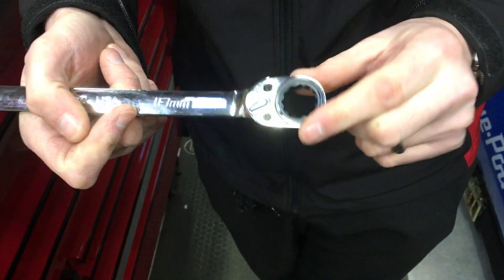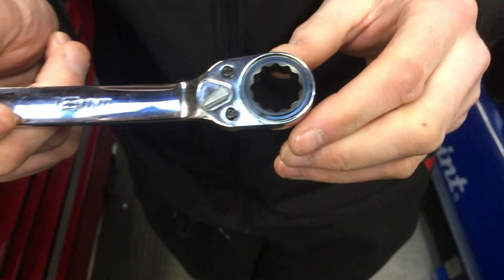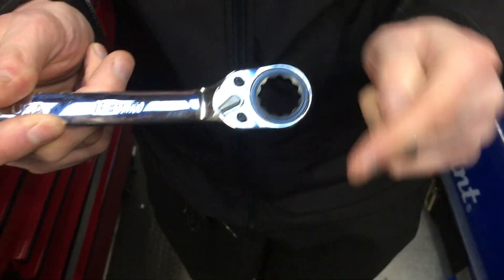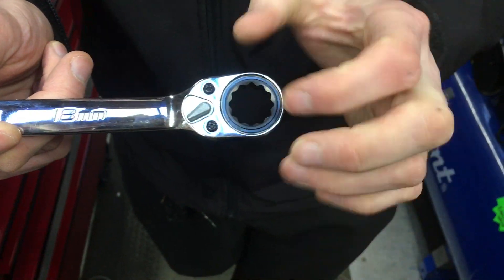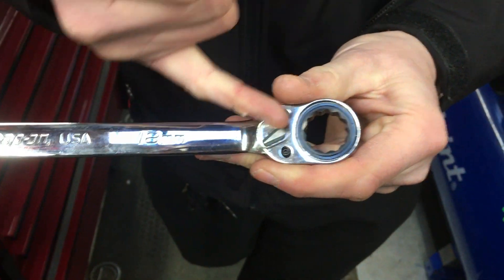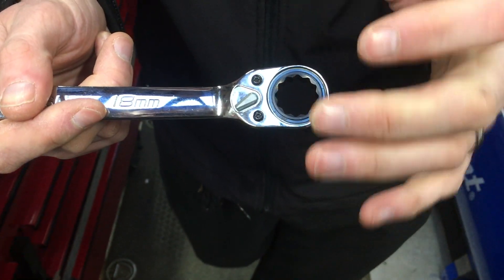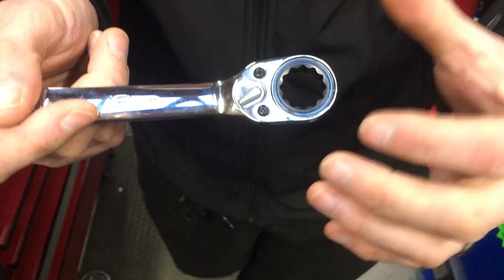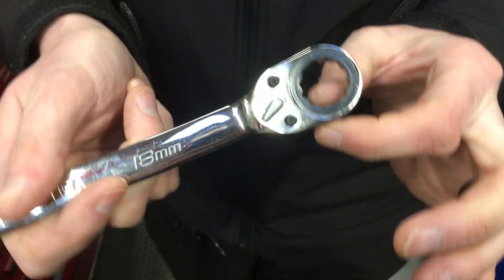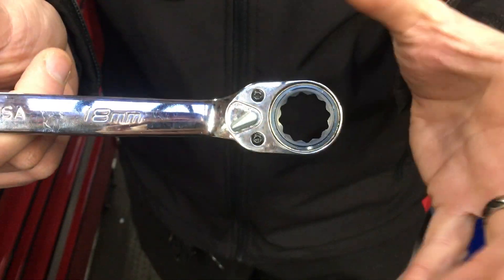Now we go down to the super end. This is the new 80-tooth ratchet spanner from Snap-on, and this is the business end that makes all the difference. It's 80-tooth just like our ratchets — it has a pawl here and a pawl here which is biting onto the main cog, so the teeth are engaged all the time, rather than some ratchet spanners which have a lever that moves the pawl inside. More teeth engaging with the cog means it's stronger, which also means we can make it finer. 80 tooth gives you lots of little clicks — very small arc — just 4.5 degrees between each click, so very fine but also strong.